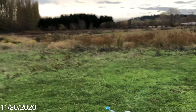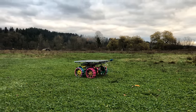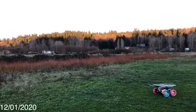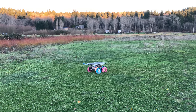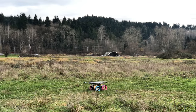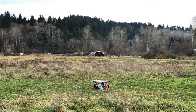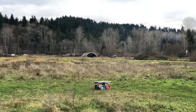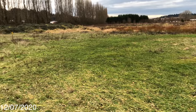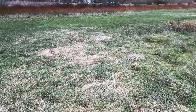November 20th — just put a fresh battery in it. November 23rd — charged the battery. November 25th — it's so pretty. December 1st — sunny all day. I've had my big 32 amp-hour LiPo in it for the last few days. When I got here this morning it was at like 6 volts — it had been over-discharged last night, probably because it was freezing cold. So I'm going to try and revive that LiPo. But right now I've got a new battery in it so it should run all day today.